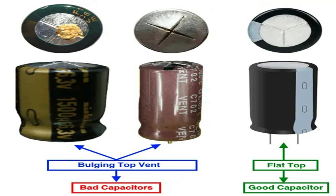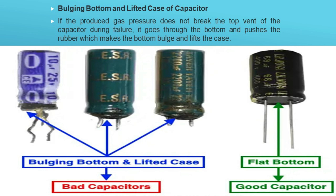Compare the calculated capacitance with the value printed on the capacitor. If the calculated value is nearly equal — within plus or minus 10 to plus or minus 20 percent — it is a good capacitor. If the calculated value is far away with a noticeable difference, the capacitor is faulty. In our example, the calculated value is almost the same as the actual value, confirming the capacitor is in good condition. The discharge time — when the capacitor discharges to 36.8% of peak voltage — can also be used in the same formula.